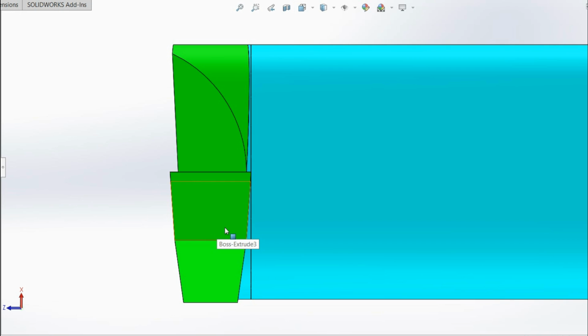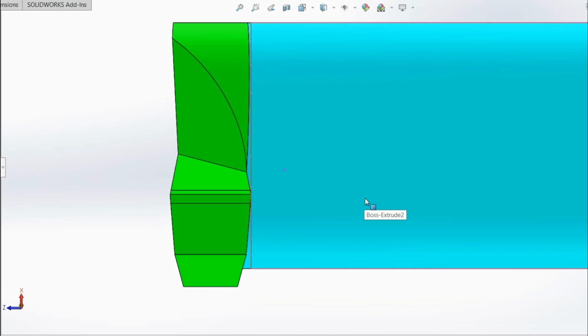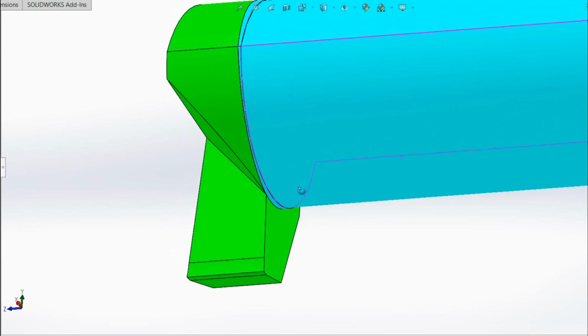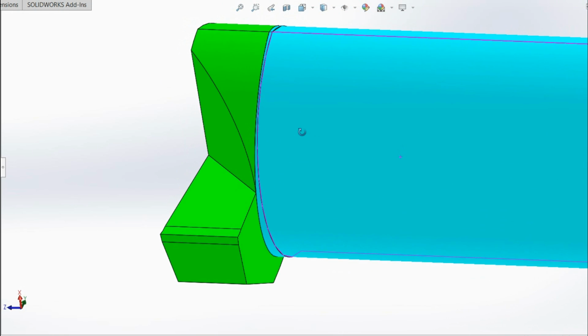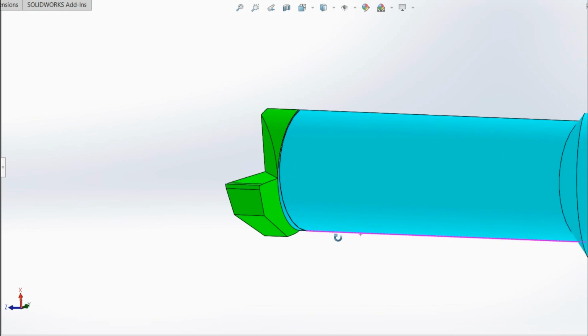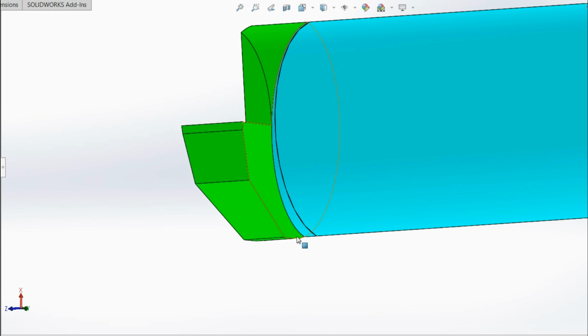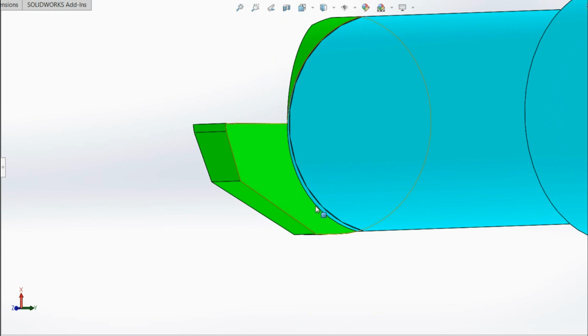Zoomed in here on the carbide piece, and we have 3 degrees of side clearance on both sides of this in this orientation, and then we have 3 degrees back clearance the same way on both those faces. Now the thing that gets tricky is if you had that carbide piece brazed on square onto this tool holder, you would have to hand grind this as it wraps around, because remember, this comes very close to the bore all the way, so you can't have a sloppy type of runoff here of this clearance.